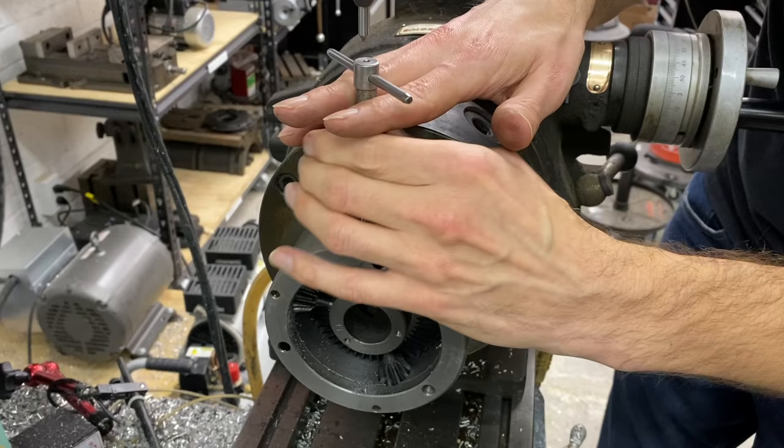We are within a thou now. Usually when I get within a couple thou I'll go around and tighten all four because you want to make sure all four have contact and relatively equal pressure on the back plate. We're within a couple tenths right now, and it gives you the ability to dial in an individual part that needs to be perfect in just a few minutes. Bringing this back to zero, we're getting plus or minus about a tenth. For a three-jaw self-centering chuck, that's pretty awesome. And we're good to go.